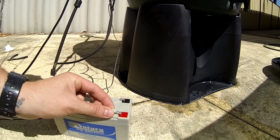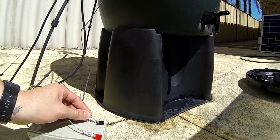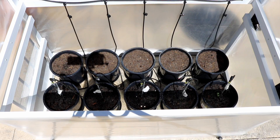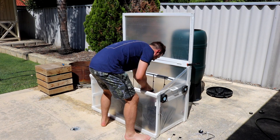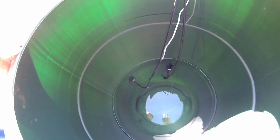I tested the pump using the battery by connecting the cable to the terminals. Initially I tried one pump to see how the spray would go and it's not too bad, though for the number of sprayers it might be slightly too weak — I may need to run it a bit longer or source a better pump. Using the rest of the four millimetre flexible hose I terminated the last five sprayers, put the stakes into the other five pot plants, then put the second DC pump in and covered up the rainwater tank.